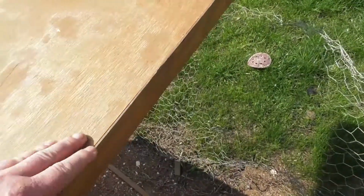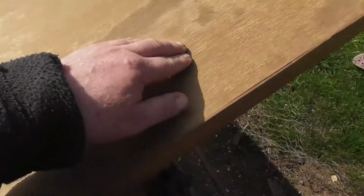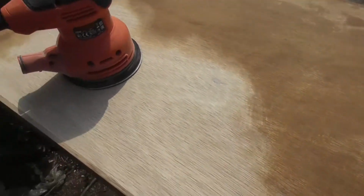There was a dye on here that my discs weren't really in a position to remove, so we've upgraded our discs, and I've just literally been here a minute and I managed to cut into that. So what I'm going to do is take this right back to bare wood now, get it even, I'll re-dye it and I'll get my smoother discs, but instead of using the DA I'll just literally run my hand over it a few times, because it's water based, so it opens the grain up, real nuisance when it comes to varnishing. But we'll sand it back, try and fill, sand down and get it even, and then we'll whack over some varnish, and then we'll get the other two cupboards and go with it from there.